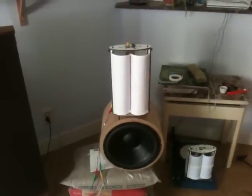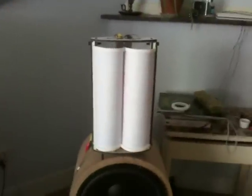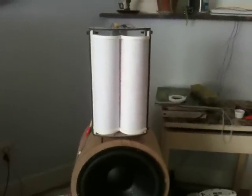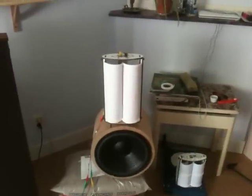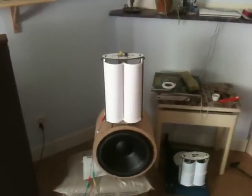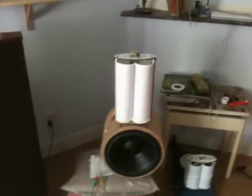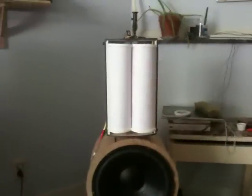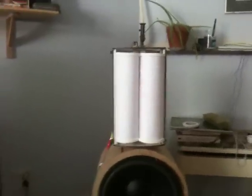It's open baffle as well. It's a little bit higher efficiency, I think, in the mid and high frequency. I crossed this at 350Hz with a 12dB slope. And I had a low shelf on the Ruminoid as well as a high shelf to match the efficiency of the woofer. So from the mid frequencies — from 500 to 20k — the Ruminoid is 7dB down.